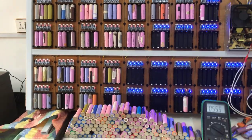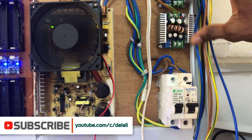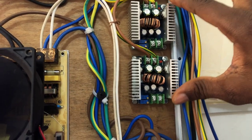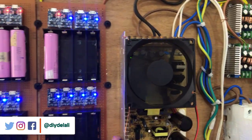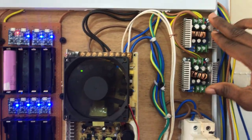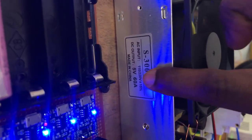At this part we have the power supply at the top. Here we have the buck modules that will connect to a solar panel and step back the 18 volts from the solar panel down to 5 volts at 20 amps to charge the boards. Here we have a regular AC power supply because we don't have the solar panels ready yet — this is a 5 volt, 60 amp supply.